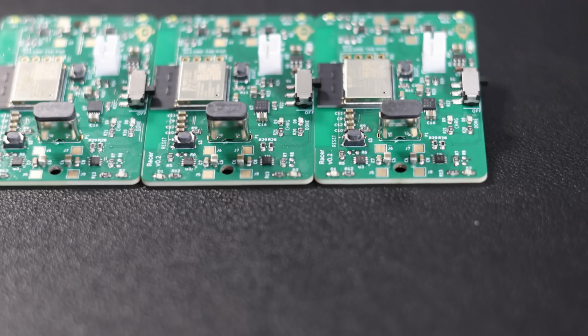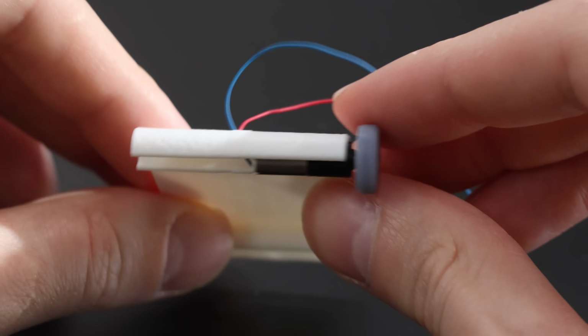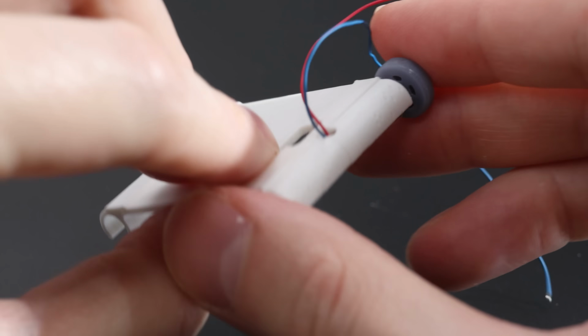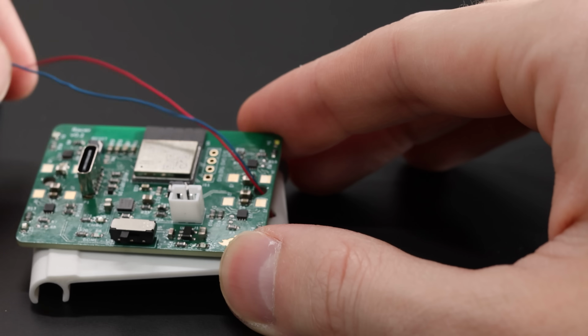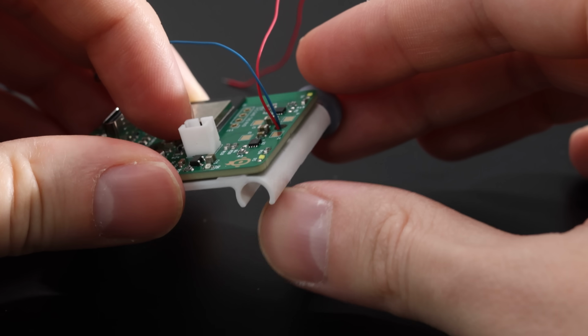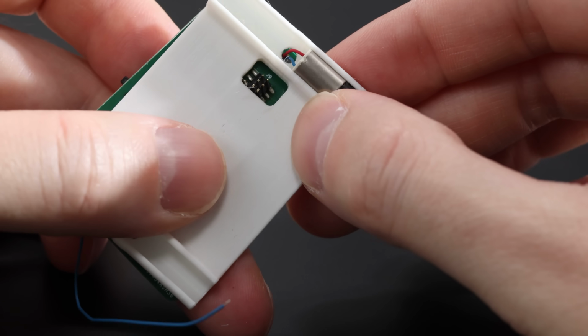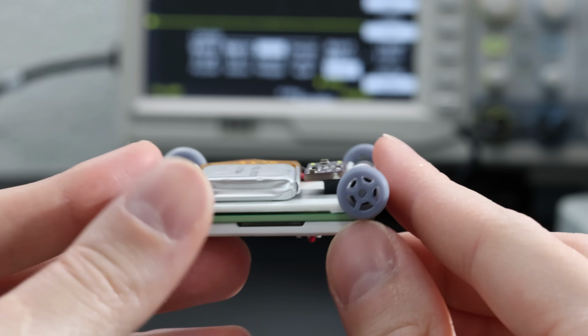Check it out. I designed the enclosure for easy printing and assembly. The motors snap into place without any screws, and they hold without any glue. The PCB mounts on top of an enclosure with a tiny help of double-sided tape. The motor wires fish through the enclosure and the PCB for a nice solder at the top. The battery fits snugly under the car, again double-sided tape.